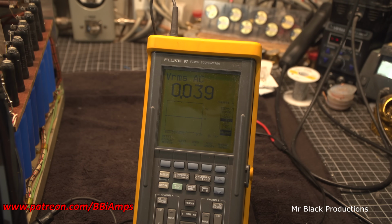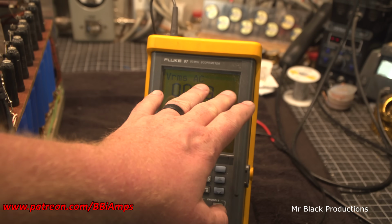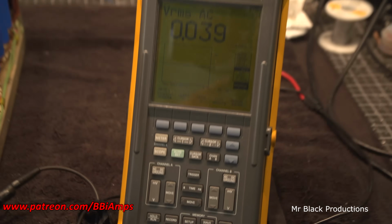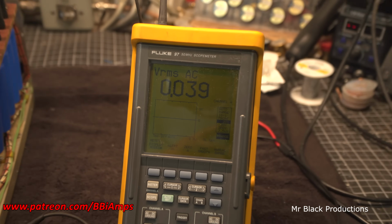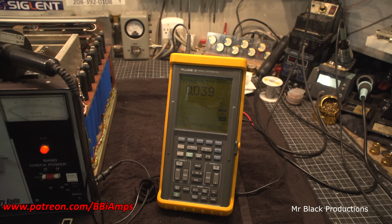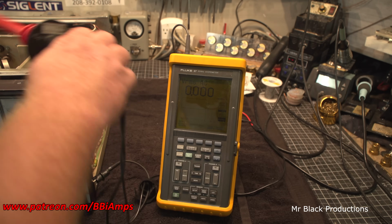And zero, and I mean zero. We're way down in the weeds. This level of noise, we're talking, this would be 1,000, so in theory this is 36 volts worth of noise, but then when we see the actual scope, nothing. And that's what I call probe flutter, otherwise just ambient noise from the probe itself. When we shut this down, we're going to see a little bit of a drop. We're just talking ambient noise though.